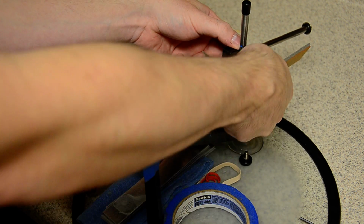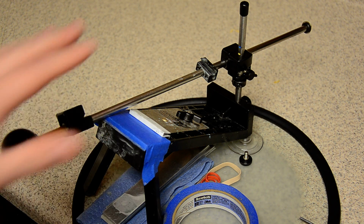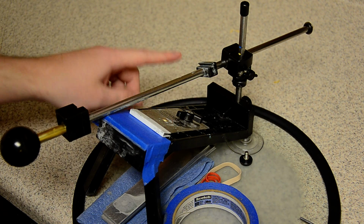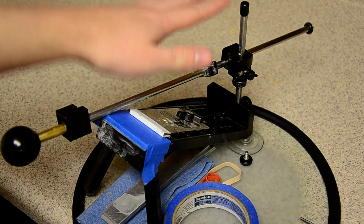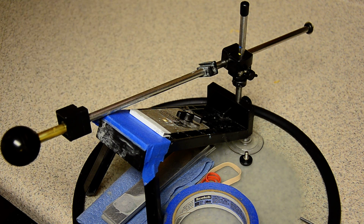And what you've done right there is you have taken all the manual input out of adjusting the angle. No longer do you have to mark the edge with Sharpie and adjust this arm. You just use the collar. And I don't know if you've noticed, but the arm is actually setting lower than it was before because this stone is thinner. So let's say you move on.